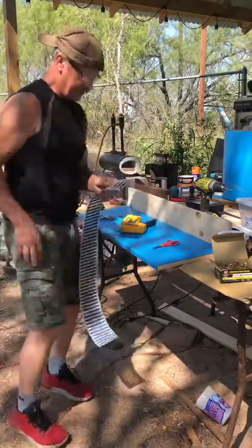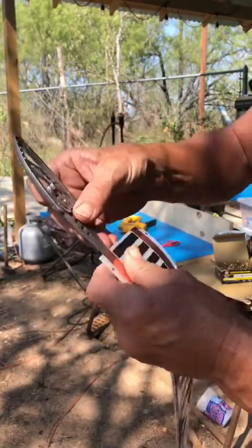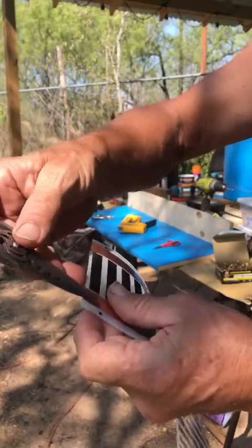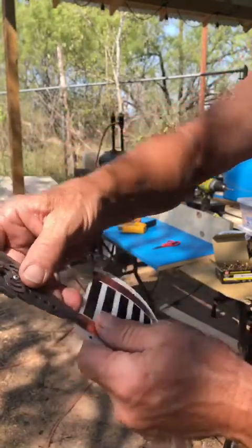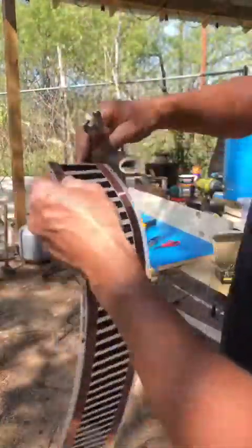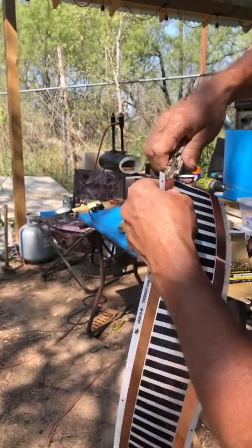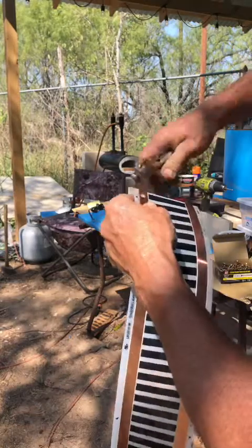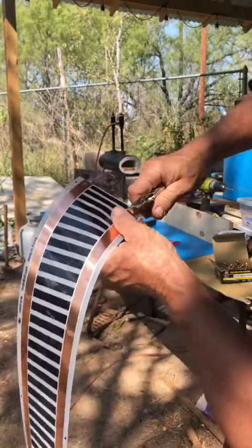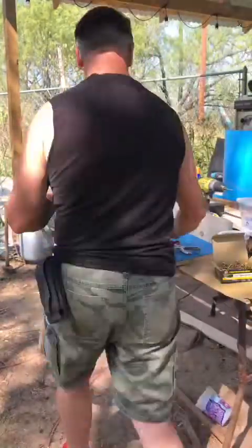Next step, take a knife or something, and this is a little bit of a tricky part, but you go in here and you separate. There's an insulation. You see how my knife blade went in there? That is where you make your attachment. First, hole puncher. Hopefully I'm in the camera here. Hole puncher, come in about, you can come in any length, but we go about there. And here. Try to stay kind of centered in the copper. Give you a better connection.